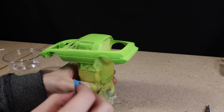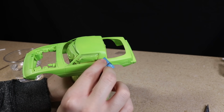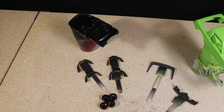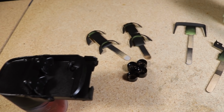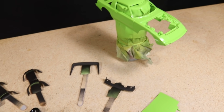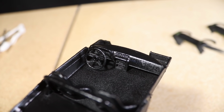Between some of the coats of paint that I applied to the body, I used some 1000 grit sandpaper to remove any dust or other imperfections from the paint. After a few coats, everything was looking great. The primer applied to the interior gave it some cool texture.